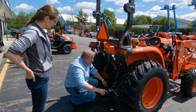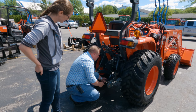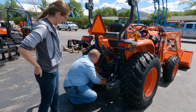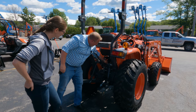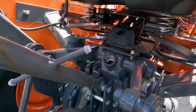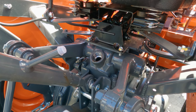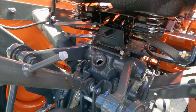You have a rubber cap over your rear PTO — that's just to keep dust off it because you want to keep this greased. You have a draw bar right here: if it's in your way, there's a pin, you can pull it out, make it longer, hide it away, or spin it around and put it in backwards to get different dimensions. Right here is your hydraulic fill — that's where you add hydraulic fluid if you need to top it off. Just remember: a little bit of hydraulic on asphalt or concrete expands and looks like a lot more than you lost. So before you go crazy adding hydraulic, really check it out first.